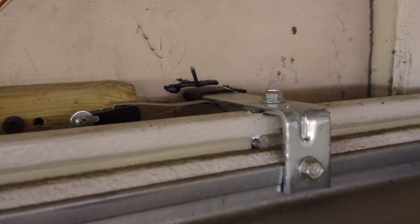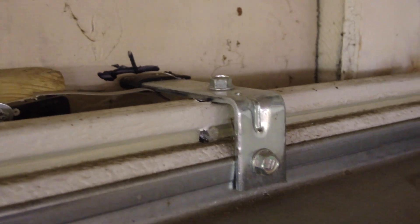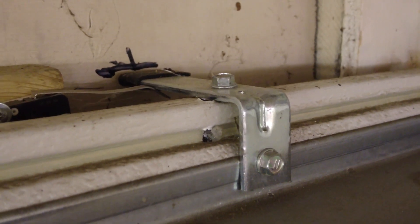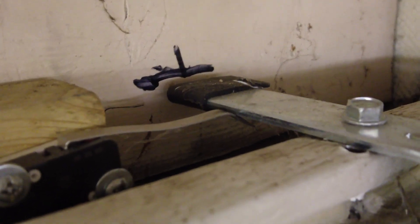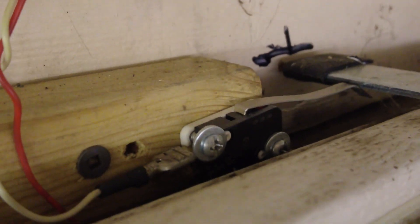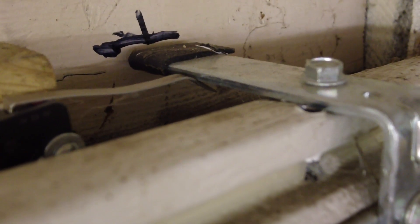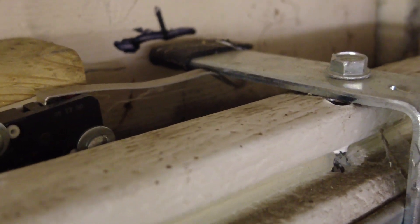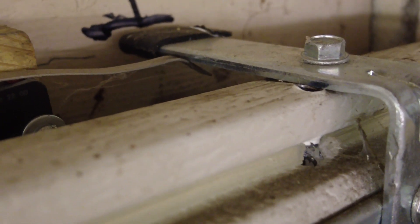I'll show you how I got this switch mounted on the top of my garage door. This is the very top edge of my garage door. I've got one of those 90-degree metal brackets you can get in the hardware aisle at any hardware store, with some heavy-duty sheet metal screws holding it to the door. I had to cut one side to get it to the right length and left the top side long. The switch is mounted right down there on a piece of wood. As the door opens and closes, it hits that long arm on the micro switch. I had to bend it here and there to get it just right, but once you get it where you need it, you never have to touch it again. It's worked fine like this for several years.